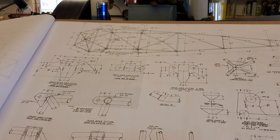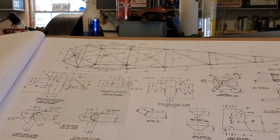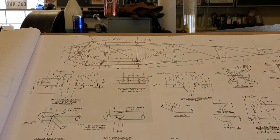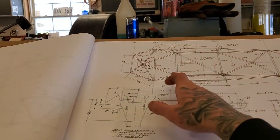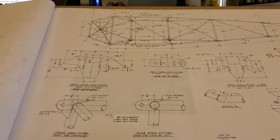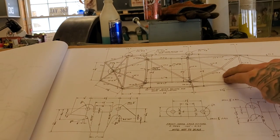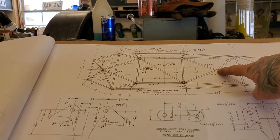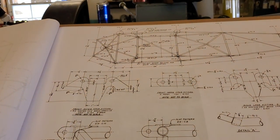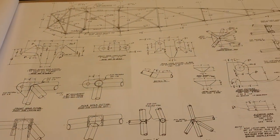Engine, floats, and wing covered. The tail is going to be like the PA-18 — exactly the same with electric trim jack screw. For the doors, I'm doing the cargo door style. I'm doing the L-21 style greenhouse, so there'll be a skylight back to around that cluster there, and the side windows will all be glass. Seaplane-style doors that hinge upward — aluminum frame, all plexiglass. Should be lots of light and good visibility.